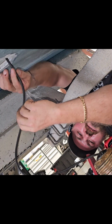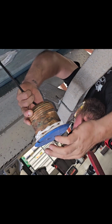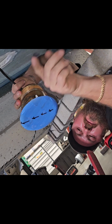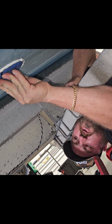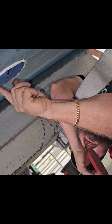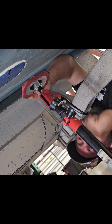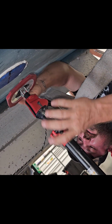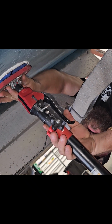All right, now here comes the fun part. So we're getting ready to stick the transducer up. Avoid lifting it by the cable is just another note. You can see my arrows there again, which are going to be pointed towards the center of the boat. I'm actually going to stick it in about 45 degrees away from it being lined up on that. So as I push it in, I can give a little twist, and so I make sure that any place that I didn't really put even amounts of sealant, that helps even it out.